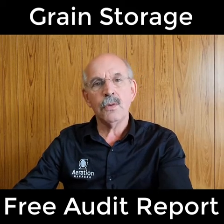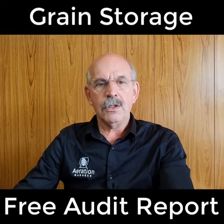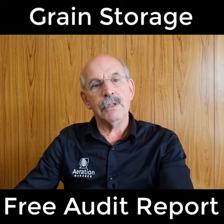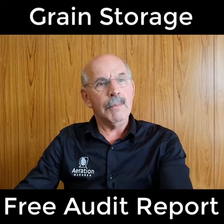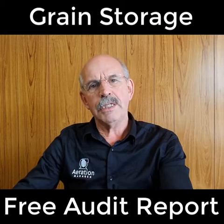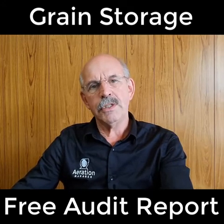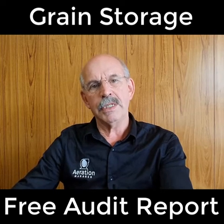The storage process is what the fans are meant to work on. If you're cooling your grain, let us know at what temperature you're harvesting, but also what the target temperature is for your silo. For example, if you want to minimize the risk of weevils, bring it down to 18 to 20 degrees and we will work out what sort of fan you need for that. If you're drying, tell us the moisture level you're harvesting at and what moisture level you need to achieve for selling later on.